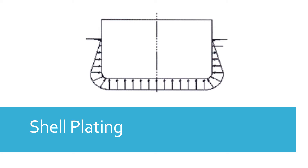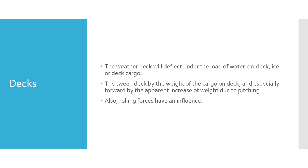The pressure on the shell from outside depends on the draft of the water and varies with water depth. In the diagram, you can see how the distribution of pressure forces around the shell plating takes place due to the differing water pressure outside, which also depends on the shape of the hull. This difference in pressure between inside and outside the shell plating creates forces experienced by the shell plate.